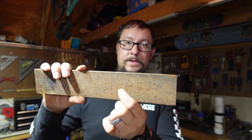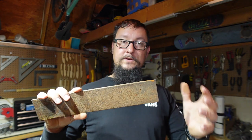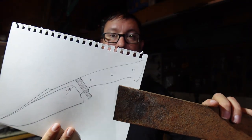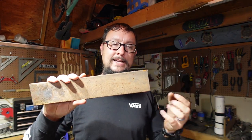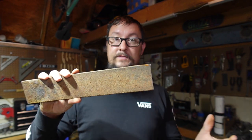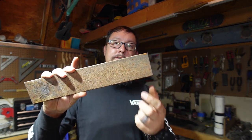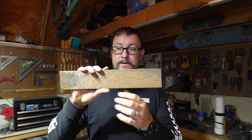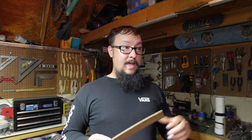I'm also going to take a rectangle out of the handle section. That doesn't mean the handle is done — we've still got to do a lot of forging to get the actual profile right because there's a whole lot of profile there that is not rectangular at all. But it's going to save me probably an hour worth of forging. Plus the piece I cut out I'll be able to turn into a scrap knife later, so that's even more content. We're going to do some of that cutting, then put it in the forge and start forging this thing out.